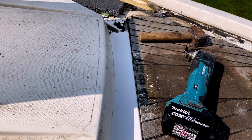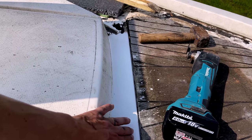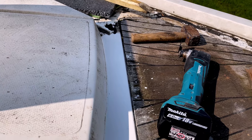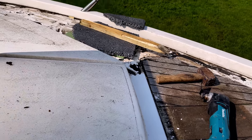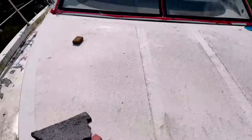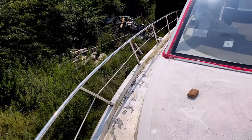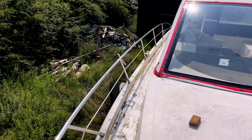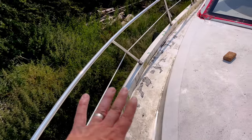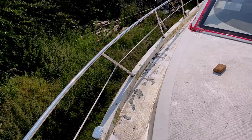What we'll do is when we've done the other gel coat repairs, if there's anywhere we need to come in again, we'll just grind that out and we'll spot that again and we'll get rid of that little halo or outline. And I've gone along all the side deck and sanded the tops of all of those all the way down there, so they've all been flattened off now and ready for polishing. But it also means now we can clean this deck as well, which would be great. So then we'll be ready for polishing.